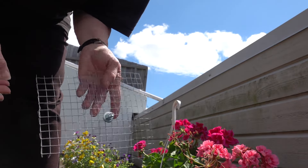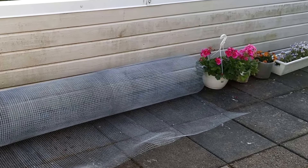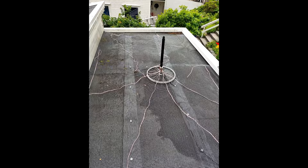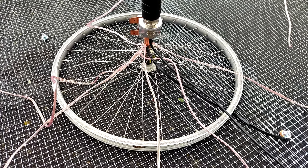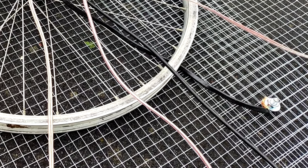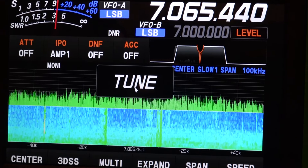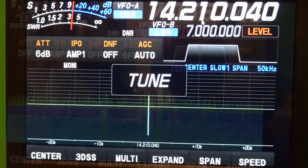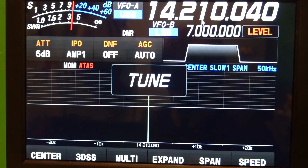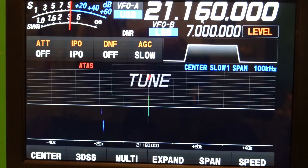The wire mesh is pretty good because it's welded and galvanized — I don't think it's going anywhere and probably won't rust very much either. I let my son help drag it up on the roof because I'm not very good at climbing anymore. I grounded the antenna pole to the mesh. I still had a bunch of leftover radials — I'll probably ground them to bolts too.